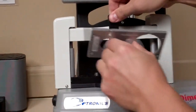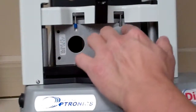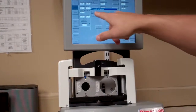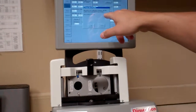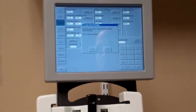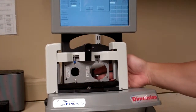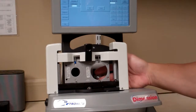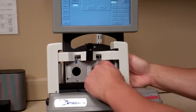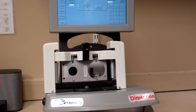Open the jaw, place the tool in, and let the jaw close — you'll see the little notches where the teeth close on it. Hit Calibrate, and it will prompt you to confirm the large hole is on the right. Hit OK. The stylus arm will pop out and fall loose — pick it up lightly with your finger, lay it into the bevel, push it up against the front, and hit OK. It will take a measurement.